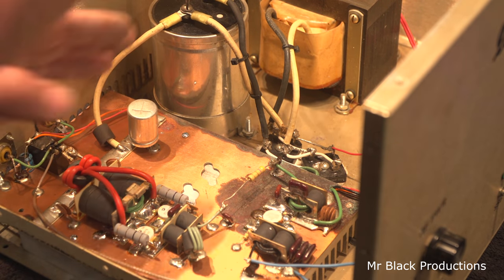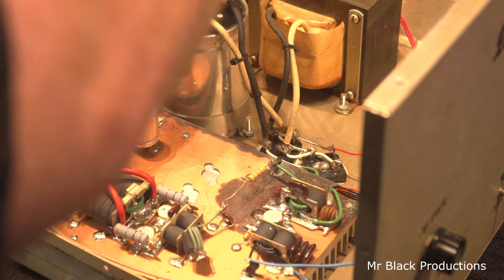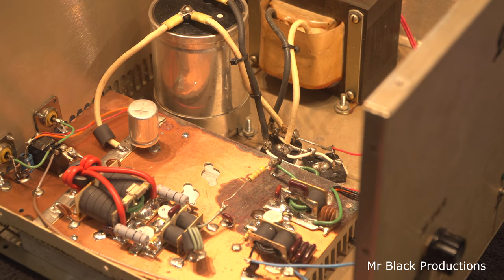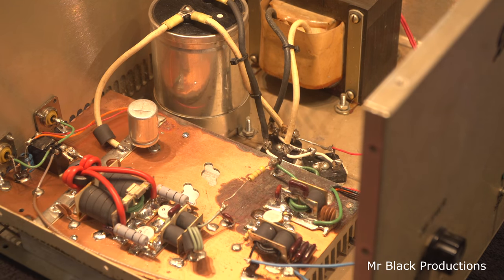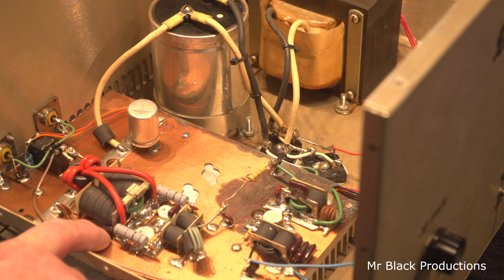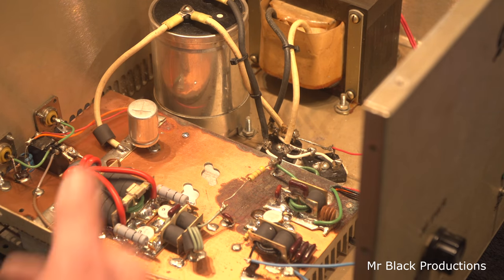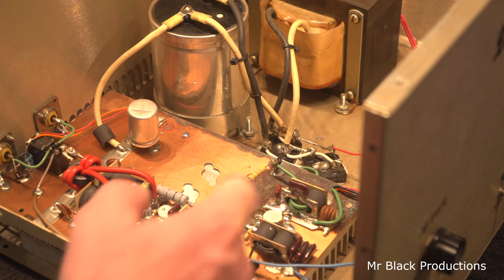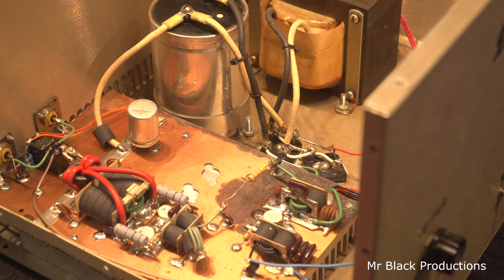I think that's a problem. Okay. Now, assuming that everything is right with our rectifiers, we're good to go. Added our 120 pF capacitors. Gave it the 5-watt resistor upgrade. Did a power wire upgrade to it. Added two 2879 HG16 DO8s to it. Rebuilt the driver section. Put a 2290 in it. This should all be correct the way I understand the things in the universe to work.